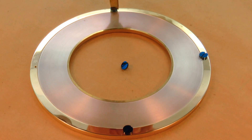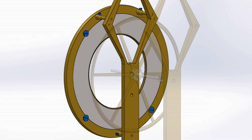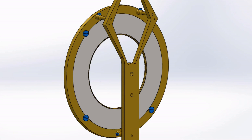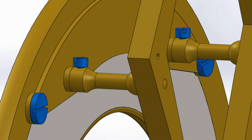The original plan was to use screws to hold the chapter ring captive, and then install dial feet and pillars like this. But after living with this idea for a while, I've decided to modify it. It means I don't have to make any more holes in the bezel, and it pulls the dial pillars down below the pivot holes, which I think makes the whole arrangement look a lot better.